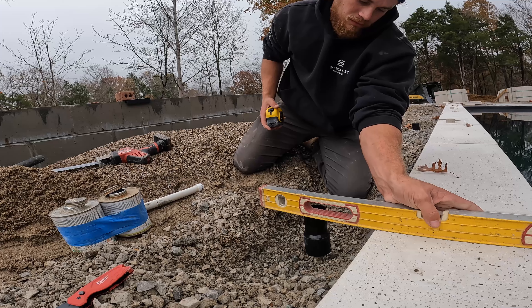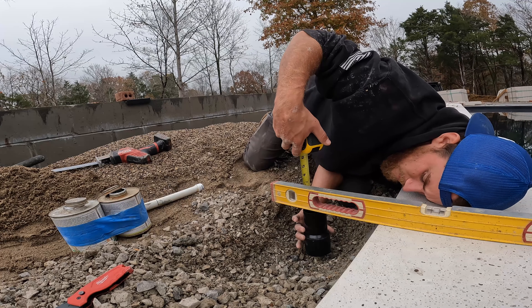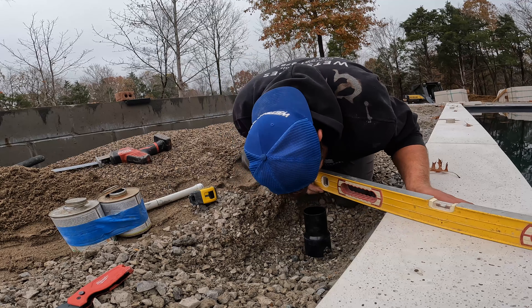I'm going to go three-quarter for my cap — that should be it. Checking inside, I've got plenty of coverage. I might pop it up just a hair to get that three-quarter. The drain is a little bit sloped because the pipe's not perfect but we'll make up any inconsistency with the stone when we go to set it. We can always maneuver the stone to make it fit perfectly. After that, I'll throw in my plug. It's winter time so we want to make sure that's in. Very important — don't forget the weep holes in here for drainage. Make sure that's covered with loose gravel material.